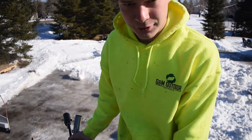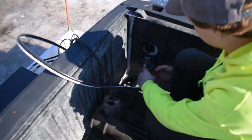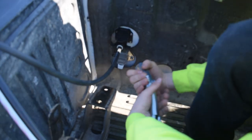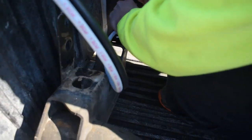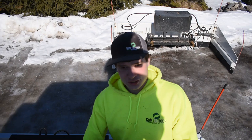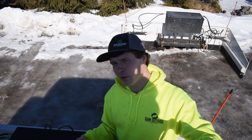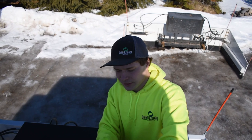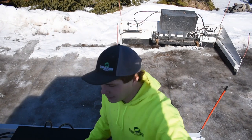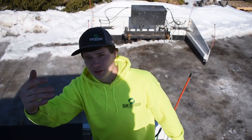For the mount, they take off your old hitch receiver and put a new one on. Inside here you've got a seven-way for the black plug — plug that in there — and then this big one. The big advantage of having those connections inside here is that they're protected and out of the way. This morning I had granular salt in the trailer and the trailer brakes didn't work because of exposed connections. Having them tucked in here means they won't get full of snow or get ripped off — it's way better than having a tailgate off.